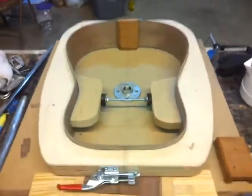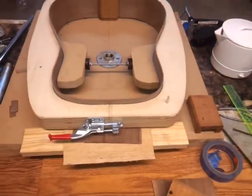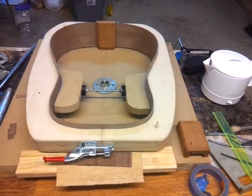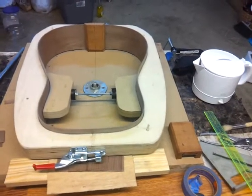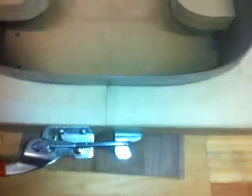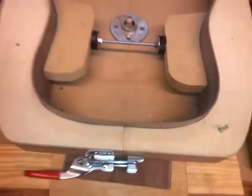Okay, we're back, and it's time to glue up the neck block. This is the critical one. This is really the lining up of the whole guitar. You've got to think about it. The neck on either side of the E strings, you've got very little before those strings hang off of the neck, and we cannot have that. So this is critical. The center line and the side set is marked with the center line on my jig, which is all marked.